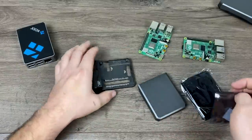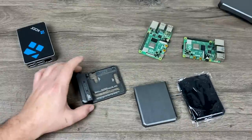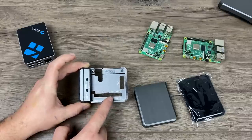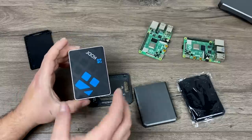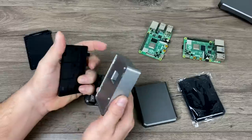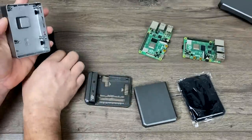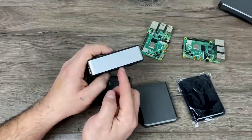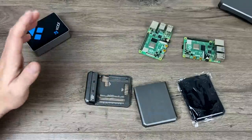If you have your Raspberry Pi inside this case and need to access the GPIO, the DSI connector, or the camera connector, all you need to do is pull the top off and you have full access — it's also marked out for you. I will admit I don't think this is going to cool as well as the Flirc case, mainly because of that magnetically attached cover. It will still transfer heat through the aluminum, but just not as much as the Flirc. With the Flirc case you can access the GPIO using a ribbon cable, but getting to the DSI and camera connector is a bit tricky. For different projects I can see where the Neo case would come in really handy with that detachable cover.